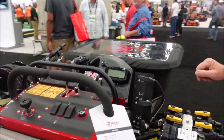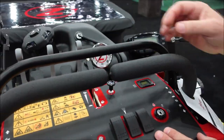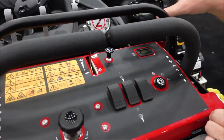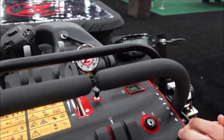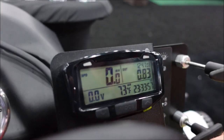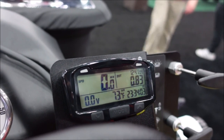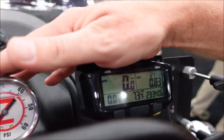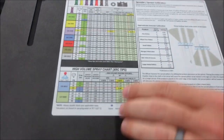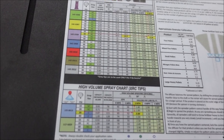As far as the control panel — what's the same and what's different compared to the smaller machine? One of the things we pride ourselves on is calibration. There are three things you need to know to calibrate a machine: speed, pressure, and what size tip you're running. You can see on this machine it's got a lot of information — voltage, temperature, time of day, and this machine has traveled 0.83 miles. But really what we need is speed and pressure. We've got a chart on the back of our knee pad you can flip over. When machines come from the factory, we normally run lavender tips, and all the part numbers are there so you can order different tips.